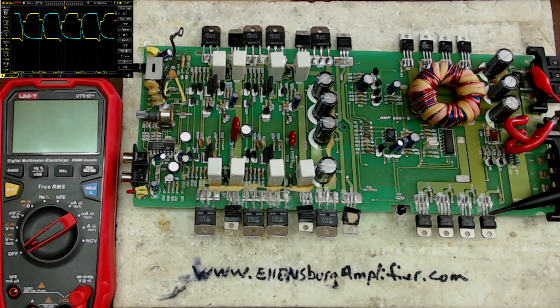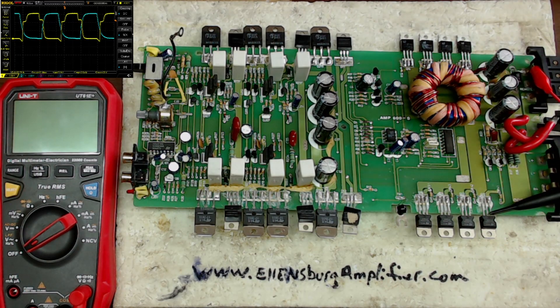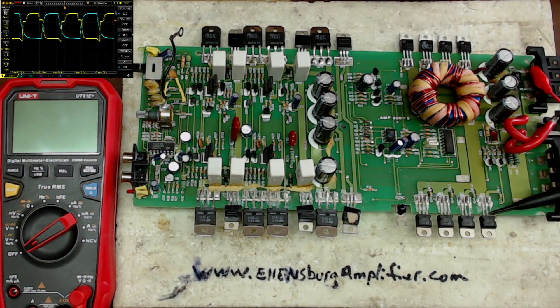Comparing that to the blue signal — the side staying cold — you can see it has a nice clean curve down. That's still an adequate drive signal; there are no shoulders, no spikes. But that yellow trace is of concern because it's not getting fully turned on and not fully turning off. Look where the blue line and yellow line cross — that transistor is still briefly on while the blue transistor is turning on, and that's causing the heat. It's running at about 42.9 kilohertz.